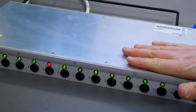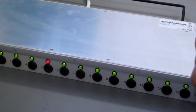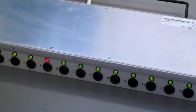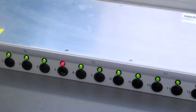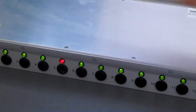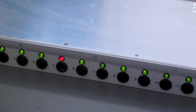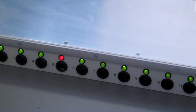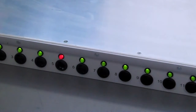On occasions we take one circuit — typically the last one in the cabinet — to feed a bay-mounted UPS at the bottom of the cabinet with a 10-amp feed. A second PDU in the cabinet is then fed by the output of the UPS. We cable the bay with two different colours: orange for raw incoming mains from the top PDU, and blue for battery-backed supply from the UPS-fed PDU. That way it's very easy to see by looking at the mains cables which is which.